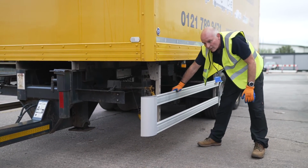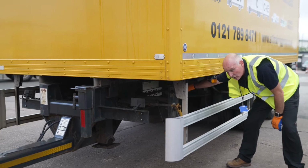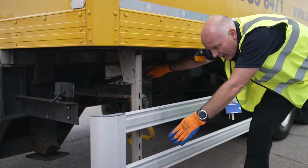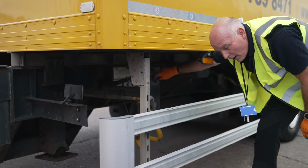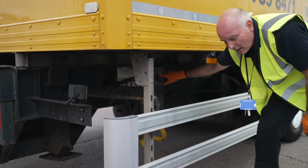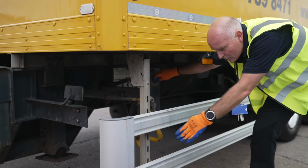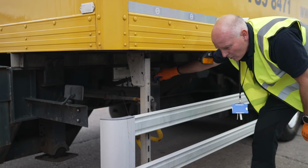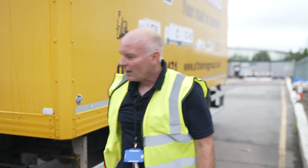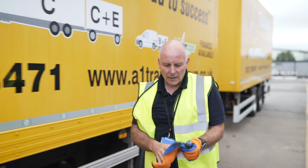and then finally on the black, you've got to release the brakes. So with the brakes, again the red, what you should do here, push the brake in, check a point on the trailer. If you've accidentally left the handbrake or the park brake off on the unit and it starts to roll, bam, we can put the brakes back on, stopping a possible vehicle roll away. So please remember, push it in, hold your position, check a mark. As long as there's no movement, after about 10 seconds or so, it's then safe to move back to the unit.